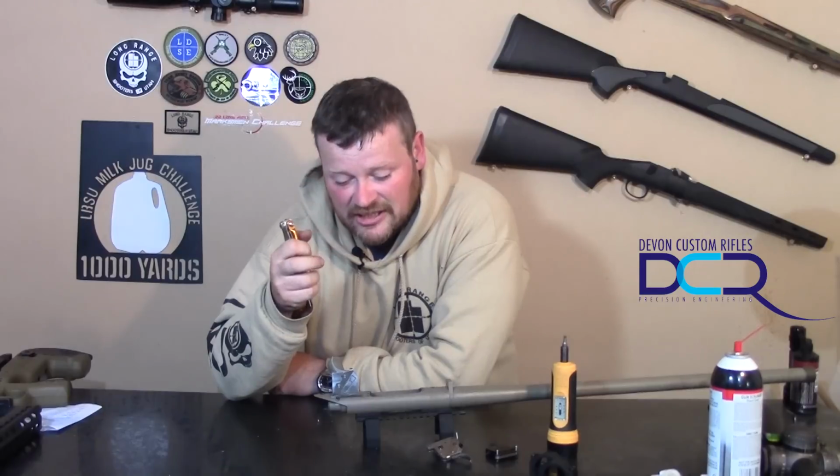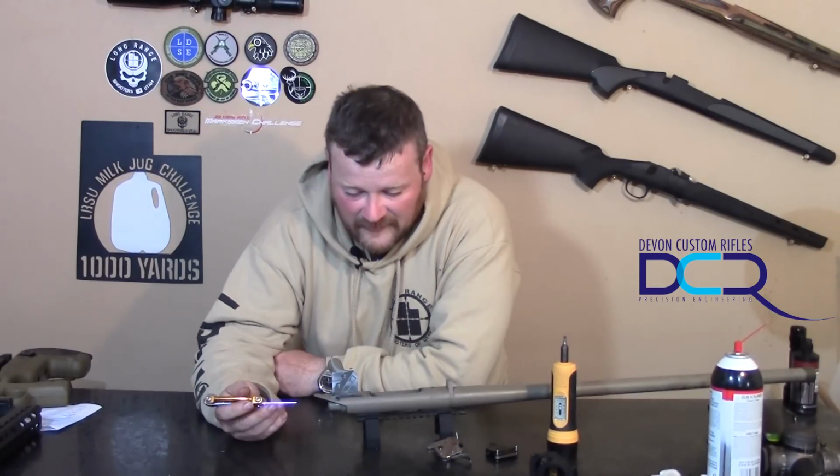But if you take too much sear off, no matter what type of trigger it is, you can get an unsafe condition. That's something you don't want. What I do is I keep working the sear in to reduce it until it fails. And how I make it fail is I'll get it to the point, I'll lock it all up, I'll get a little plastic hammer, and I'll hit the action and hit the bolt. If the process of me hitting the bolt and the action makes the trigger release, then I know it's an unsafe condition. I'll add a little bit more sear contact, and I'll do the same thing until I get a completely safe sear engagement, and I know that under no accidental circumstances is that trigger going to fire. Unless you pull the blade, it's not going to go off. And that's the way I do it.